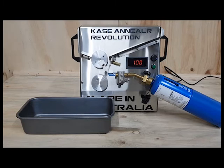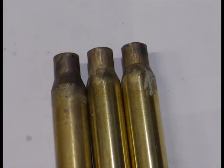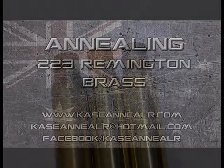The Tempilaq on your case should be just turning from the light green color to a light brown color. Once you have got your case to this stage, speed up the machine by 1 or 2 RPM. Once you have determined the best speed for each case, note this speed in your reloading logbook for future use.